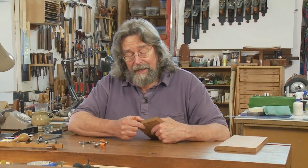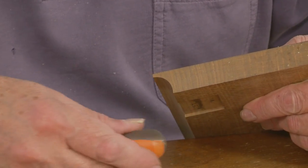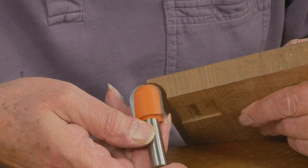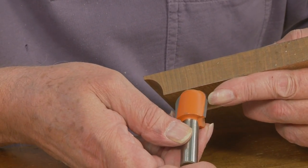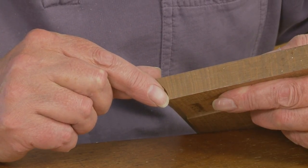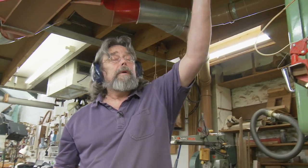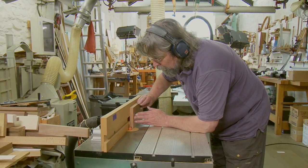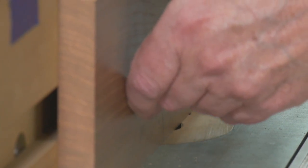Many router cutter catalogues in the past used to show this half of the joint being done with this kind of cutter. Unfortunately, the straight part of this cutter truncates the tiny returning portion of this curve here. I thought about this and wasn't totally happy with it. I came up with a plan to machine this vertically over the cutter, and I think you can see that this continuing curve machines that bottom edge as it should be done. So that's how we'll do it.